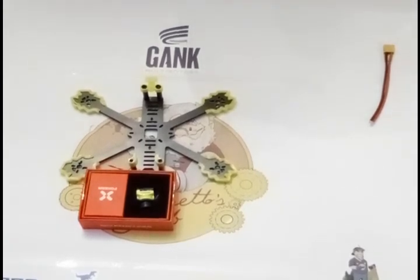So just to make sure that it wasn't pilot error, user error, I'm going to verify on the ground, which is one thing that I didn't do. I only set it up in Betaflight, was to make sure that it doesn't boot up in pit mode, or that I am actually at about the 500 milliwatt setting and not the 25 milliwatt setting.